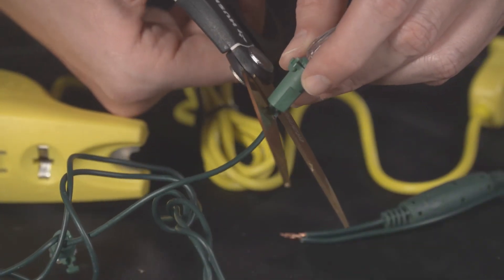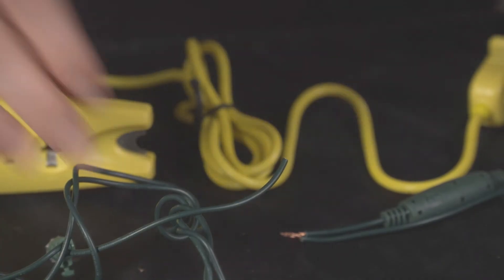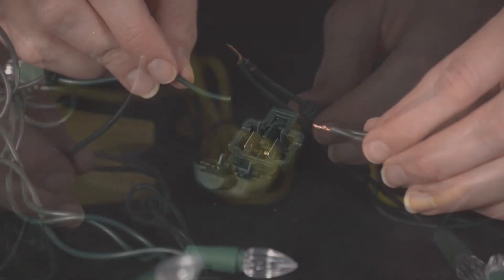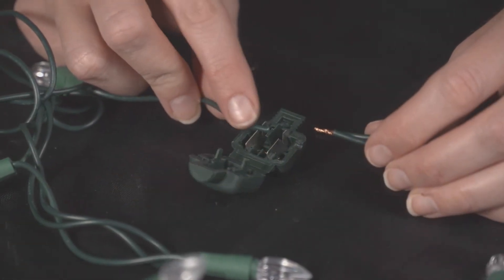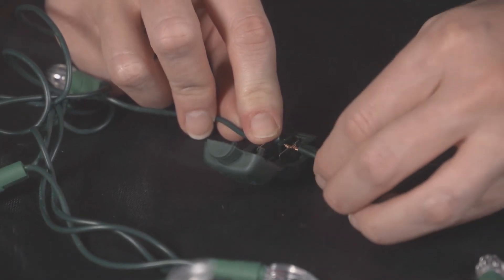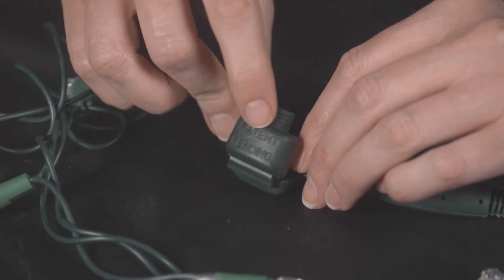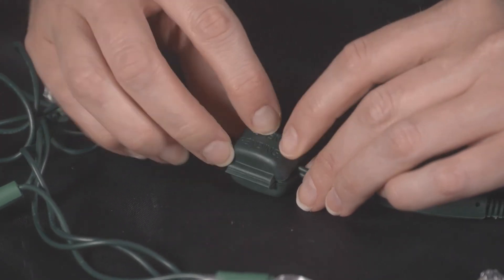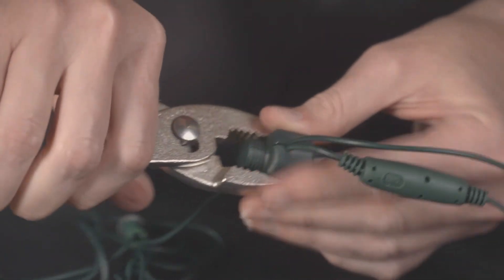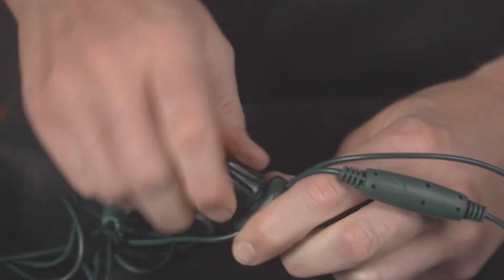Next, cut that third wire from the bulb, getting rid of that faulty bulb or socket. This wire should not be stripped. Now you are working with two wires. One wire will go into one metal channel, while the other two that have been combined should be seated in the opposite metal V channel. You need to have the two connected wires on top of one another, which will make closing the pod a bit tougher. Consider using pliers to assist you or something of the sort. After the wires are set and the pod is sealed with the cap, your LED light set is now ready to use.